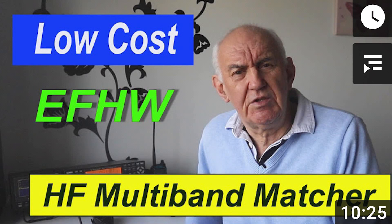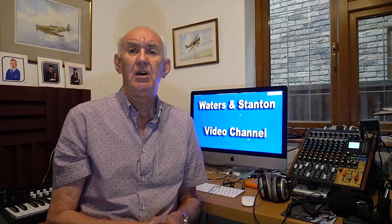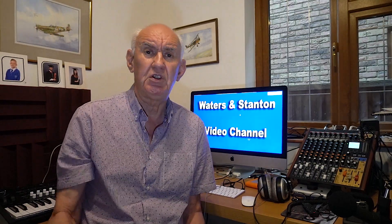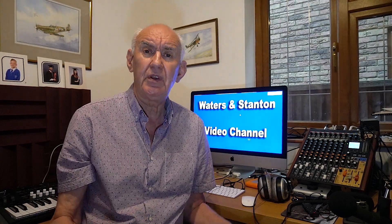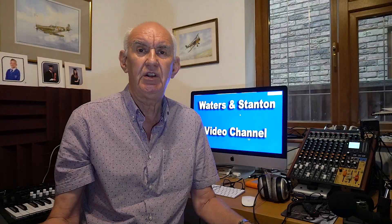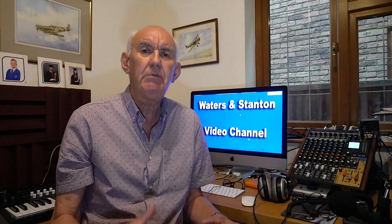Well, there is. Before I go into the details of the antenna, first of all you do need a matching transformer — I've done a video on matching transformers and I'll put a link to it below this video. You can make your own matching transformer; it's very simple. I've made it even simpler than some other videos, just using tinned copper wire which is easier to solder — don't bother twisting wires together. This matching transformer handles 100 watts and has worked fine for the last two years.